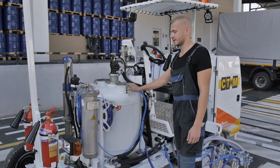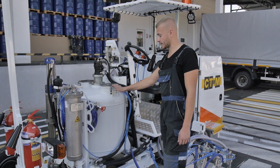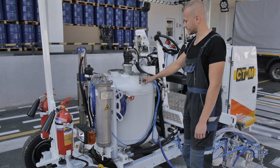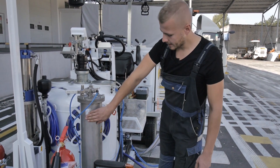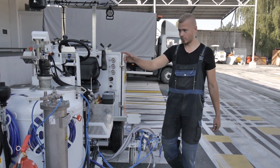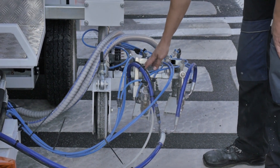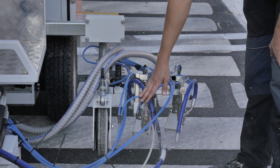On this machine, it is possible to make markings using spray plastic. Spray plastic, after cleaning the container from paint or into a clean container, is also poured through these necks. To apply spray plastic, a hardener is needed, which is poured into this container. Spray plastic is applied to the road surface through a pump under pressure through paint guns, and at the same time a hardener is fed into the spray plastic jet using this gun.